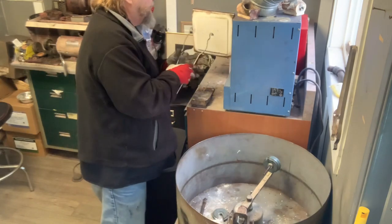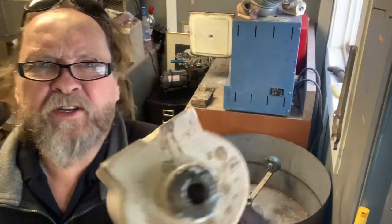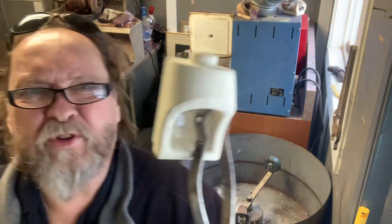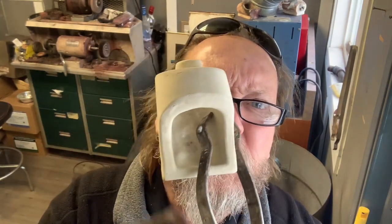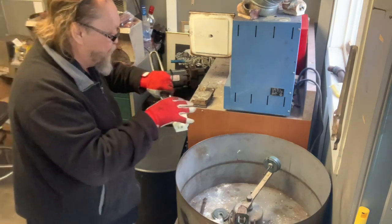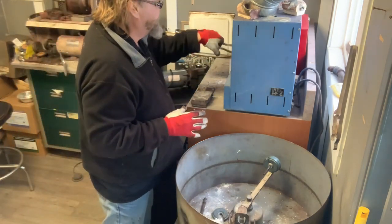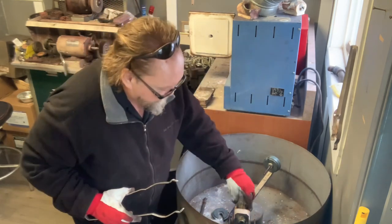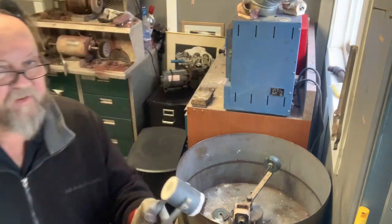The arms are in the right place. Look at how seasoned that crucible is - beautiful. I want to show you another crucible I just bought. It's new, so I made it wet and rubbed boric acid around it - you can see it's shiny in there. I poured boric acid on it, made sure it was everywhere with the water, let it dry, and put it in to season it once. We're going to use the old crucible with the gold in it. And here's the flask - the guitar pick cavity is inside here.